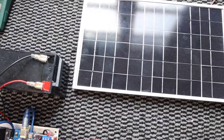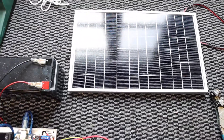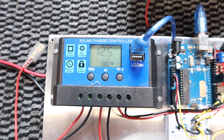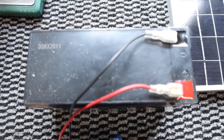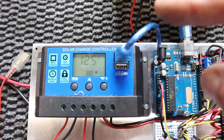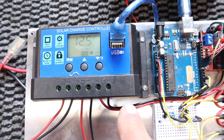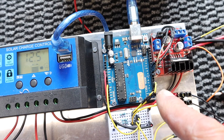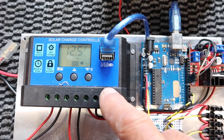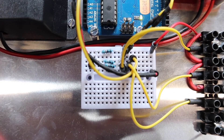Here are all the parts you've seen on the diagrams. This is the 10-watt 12-volt solar panel that'll sit on top of the chicken coop. That feeds this little charge controller — a 10-amp unit — which then feeds this small 12-volt 7.2 amp-hour battery. That will sit inside the chicken coop door. The output from the solar charger includes a USB which I've connected directly to the Arduino. Below is the mini breadboard with three 330-ohm resistors and various wires.